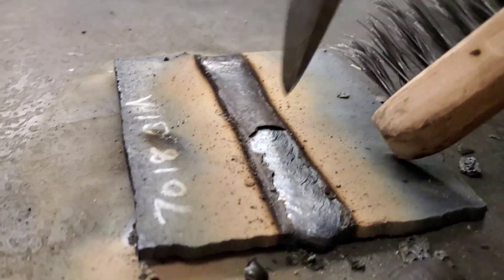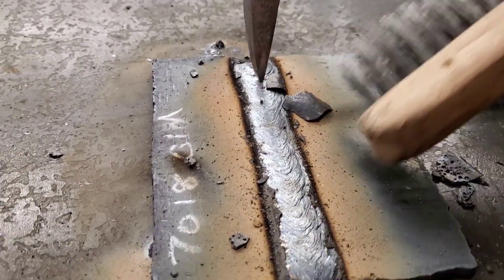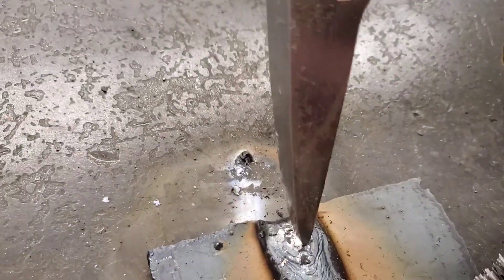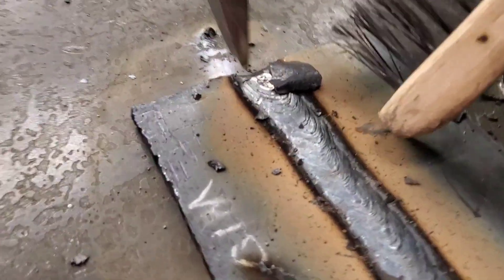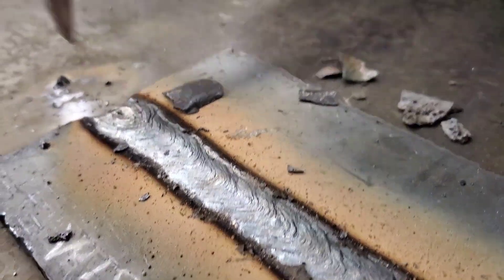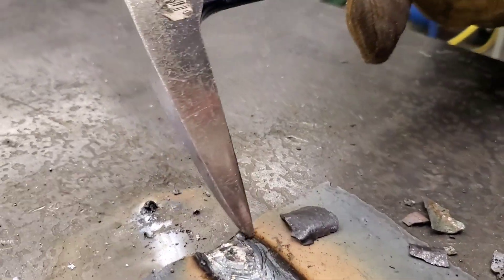Let's try to get this slag chipped off. When I got to the end of this plate, that stuff was getting really squirrely on me right about here - I couldn't control that rod too well. I got to the end, I couldn't even put a clean finish on it. It just started puddling out everywhere right here. You can see just how much more it got wider.